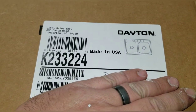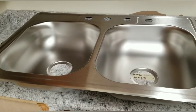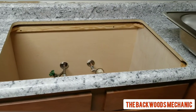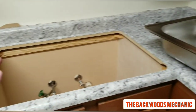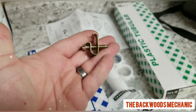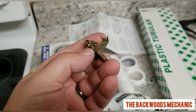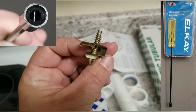Here's exactly what we've got — this is a Dayton sink, made in the USA, model K233-224. It's a nice simple two-point stainless steel, lightweight and really easy to install. Some people will tell you to put caulking around these things, but there are clips that go on these sinks. If you flip it up you'll see all these little rails — that's where the clips go into place. They're basically anchors, and once you stick that double bowl sink down, you get those anchors in place, press it up against the counter, start tightening them, and it holds everything in place.